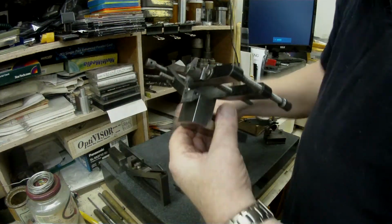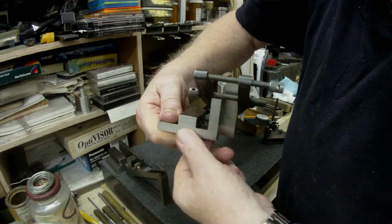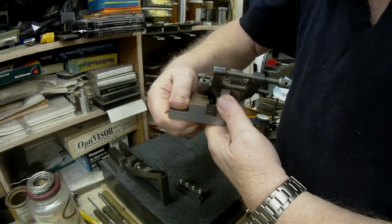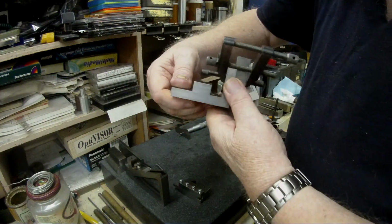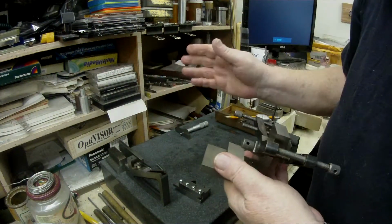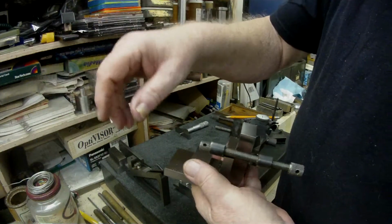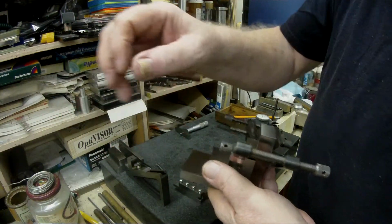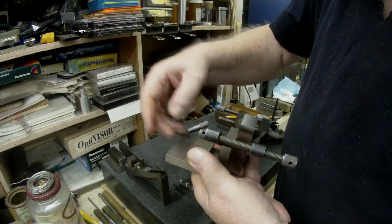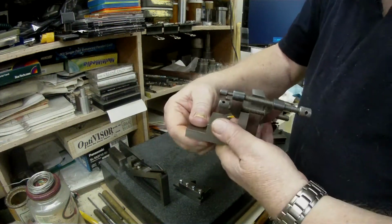Over the years that I worked, there were things like, if you can see this angle block, that was actually a punch that was either undersized or wasn't the right configuration. There would be a punch in a die, and these were progression dies, probably six or seven progressions, and the strip would go in at one end and feed through, and it would all be blanked out and formed up on the seventh stage and drop down through a hole into a big bin. They're the kind of tools that would produce probably 150,000 on a run before it would need regrinding.